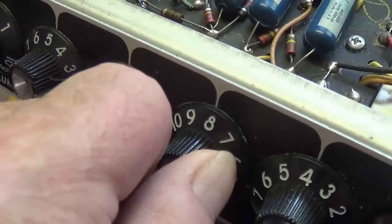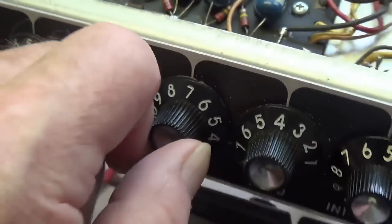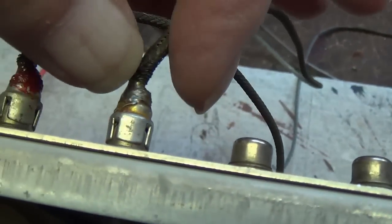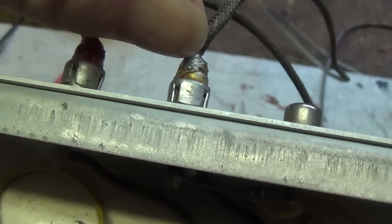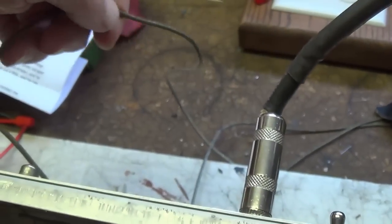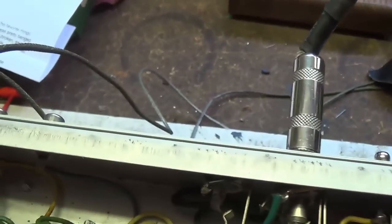Okay, so at 7, there is no reverb hum. So I think it was the routing of the cables, but just because that solved the issue in this case, you may have to double check and be sure that your shields are grounded to the little jacks, the outer casing on the plug, so that your shielding is intact and protects this long signal carrying wire that goes to the reverb and back,